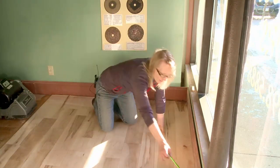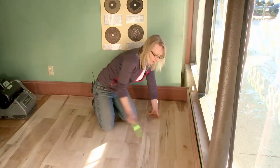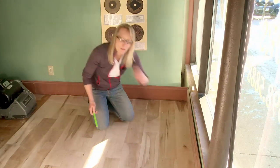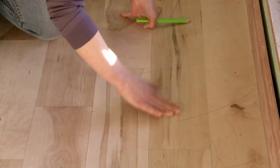So I cheat: when I'm beginning my 60 grit pass and again my 80 grit pass, I create a series of pencil lines around the room. I want to make sure I come a foot and a half or so into the floor so that as the drum sander comes along, she'll erase whatever she touches and leave behind exactly where I finished.